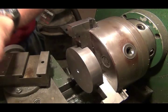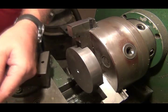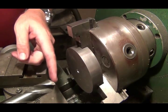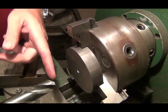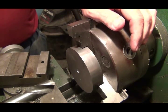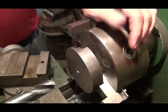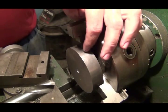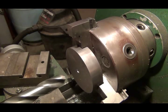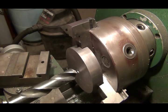When you have a drill bit chucked in a drill, your center of rotation is the center of the drill bit, and it has nothing to follow really. It just guides itself, and a lot of times those deeper holes will start wandering a little bit, and they won't go straight. So by spinning your stock, you can get a straighter hole. Not that it matters on this, but that's just a little tidbit of information, I guess.